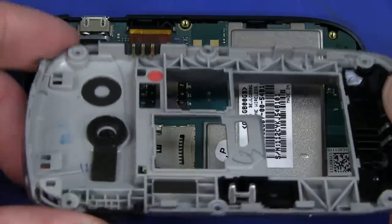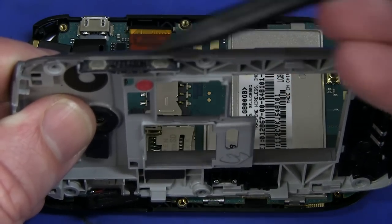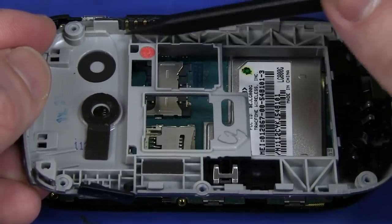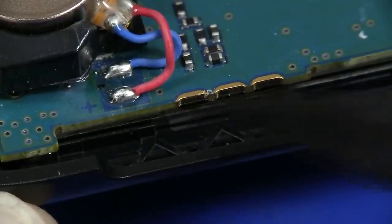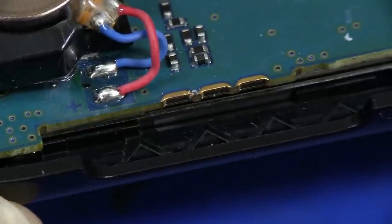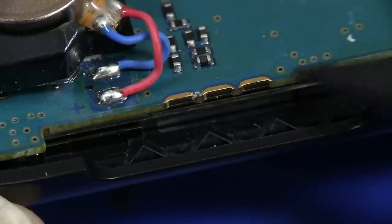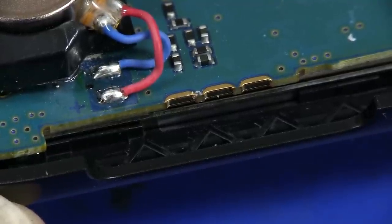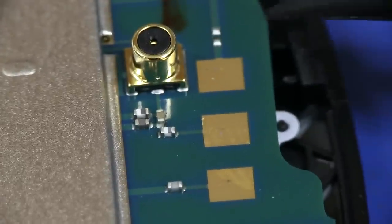One thing I did find interesting is that the little tactile buttons on the side here for the volume — there they are, mounted on that little board there. But then we've got the leaf spring contacts there. You'll notice that they've actually got side contacts on the edge of the PCB. The reason I said that was unusual is because that's an additional manufacturing step at the bare board PCB level, which usually costs more. But they're probably making 100,000 of these things, so maybe the price wasn't a huge differentiator. I'm just surprised they didn't go with a top contact solution.